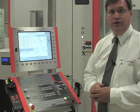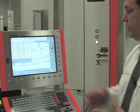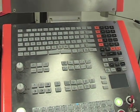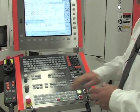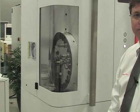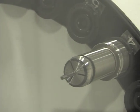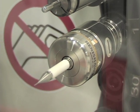This machine uses a Heidenhain 530i control. It has a built-in wizard so you can draw the part and cut away on it, visually seeing it while cutting. A standard keyboard makes it easy to edit programs and insert different types of corners when designing the part. You also have positional controls for manual mode, remote pendant, tool changes, and tool definitions. The machine has a 30-position tool changer, with position one reserved for the probe. The remaining positions support tools running up to 50,000 RPM, and tool changes are very fast — chip to chip is around four to five seconds.